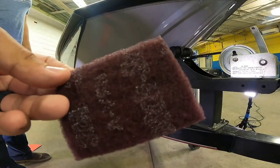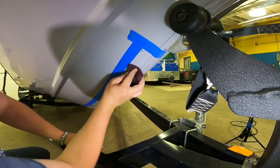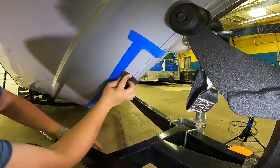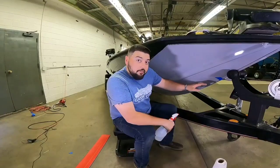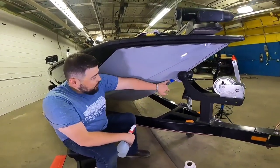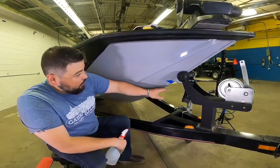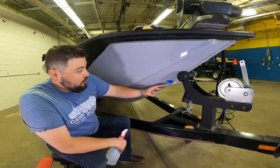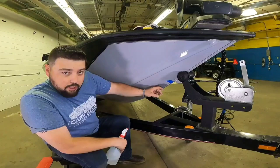Now this is where you get your Scotch-Brite pad to take care of that surface. The purpose of the tape here is just a template to make sure that where you scuff stays straight. That way when you put on your product, it will look straight and you won't see any scuffed up areas outside of the adhesion area. We've scuffed up the hull and pulled off the painter's tape, so now you can see there's a clear line where the area has been properly prepped. All you're doing with the scuffing pad is opening up the pores of that paint so the 3M adhesive can get the best bond possible. This is just lightly scuffed with that red Scotch-Brite pad.